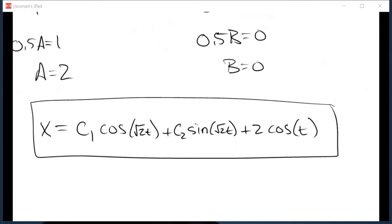I don't know if you can or not, but a famous example, of course, is some of the bridge disasters like the Tacoma Narrows Bridge. If you've ever seen that video, it's always fun to watch the twisting motion. Not exactly a spring mass system, because the cables act as springs when the roadbed is below equilibrium, but above equilibrium, they go slack. So they're just in free fall, the roadbed. Well, not exactly. But anyway, it's just something interesting.